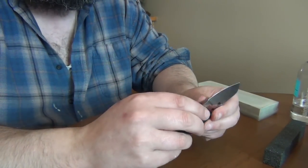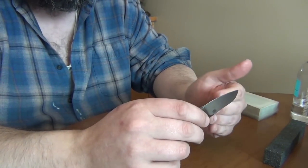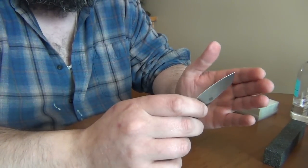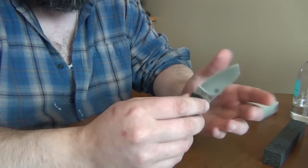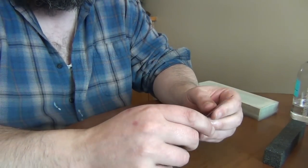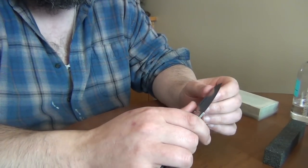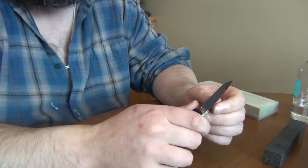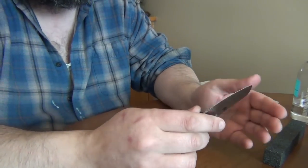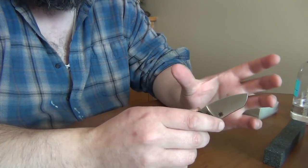For the edge bevel, the ideal stones that I've found to set the edge bevel are muddy. And that was found sort of by accident, but it's very easy to understand why. What's the main problem that people have in sharpening, or one of them? They grind down the edge, it forms a burr, and they never get it really sharp after that. It kind of slices paper okay, maybe it'll scrape arm hair a little bit, but they never achieve that high sharpness that they see on videos. And the big problem that they often have is fooling around trying to get rid of that burr.